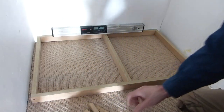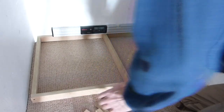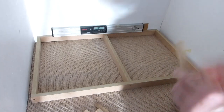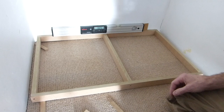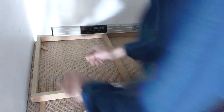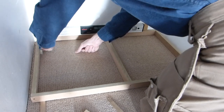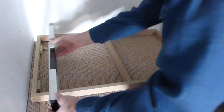I know this frame is square because I made it — it's just a little bit of drift. It's not a huge deal but I like to get it as tight in as possible. So a 4mm packer should do it, and then we level it up from side to side. At the moment it needs to come up this way by 0.4 of a degree — depending on how much space you've got you can actually do this with little wooden wedges. Five hundredths of a degree — that'll probably do. Then you can put little feet in here and screw down right into the carpet with a little bracket on it, which lets me know that's not going to move.